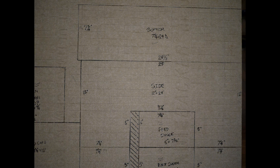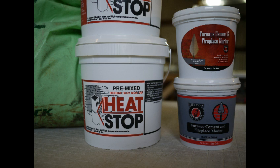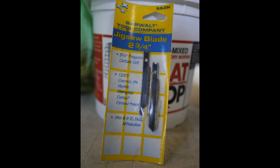Here we've got fire clay, perlite, and furnace cement. The furnace cement is sometimes called refractory mortar, sometimes it's called furnace cement, and fireplace mortar. Either of these will work — pretty much anything you can find along these lines will work. We're going to mix this with our clay. Now if you mix this with your found clay it'll work great, but in this case I'm using fire clay.